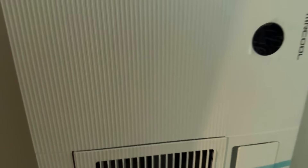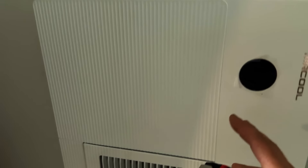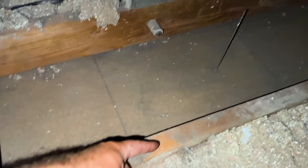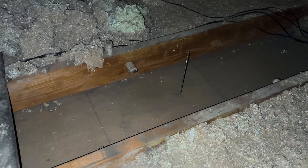We have everything measured out — it's 17 inches this way and 51 inches wide. The unit itself is about 18.5 inches, so you want your cut edge to clear it as much as possible; as long as you have stud to hit, you're golden. We drilled a long bit through the ceiling to mark the area, swept the insulation, and will saw from the bottom side.